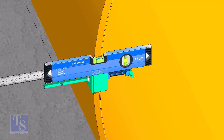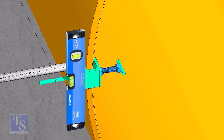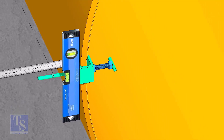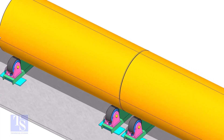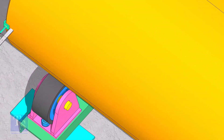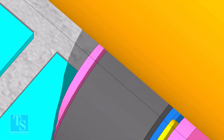Place the clamps roughly 90 degrees apart, and make sure the clamps are level. Tie the piano wire tightly on these clamps. Make sure the distance between the shell and the piano wire is equal at both ends.